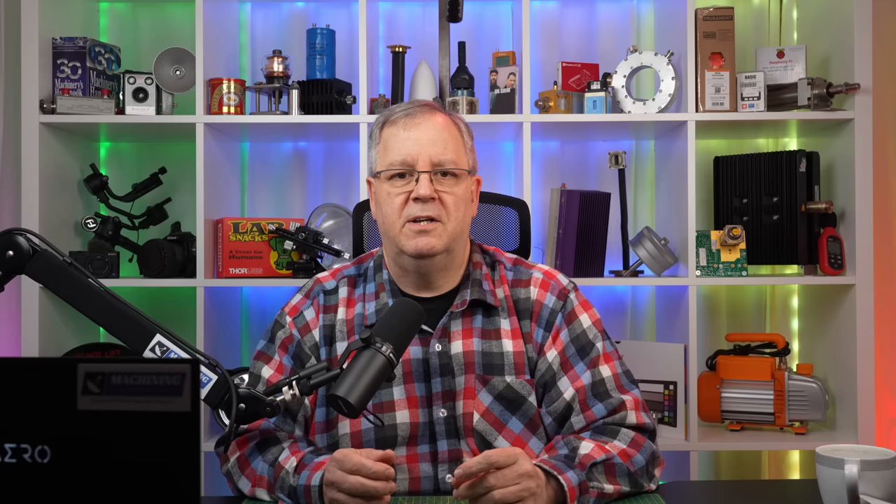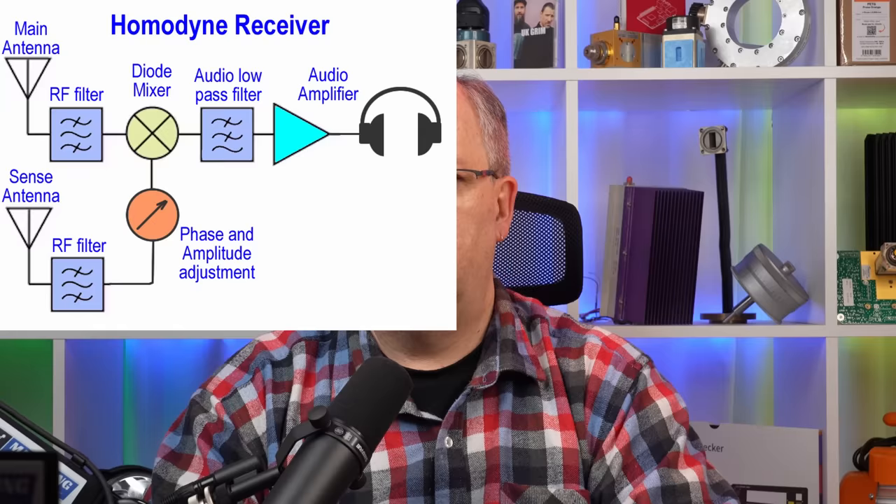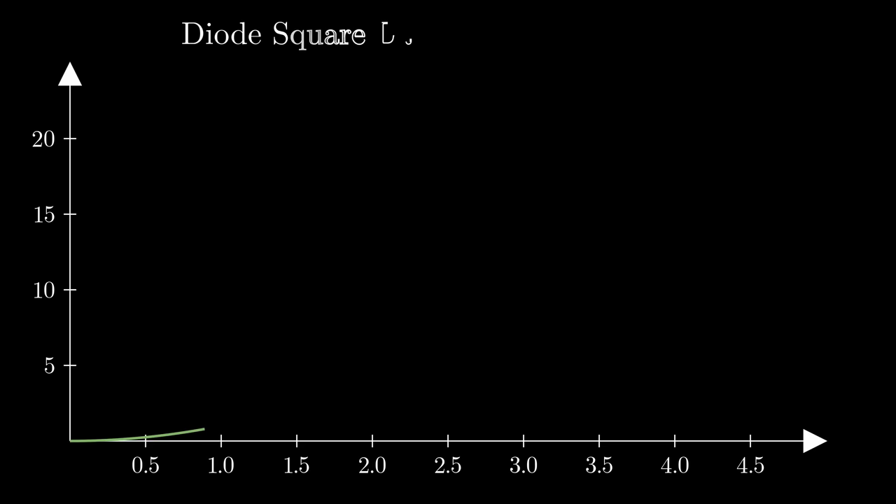Helical and Yagi-Uda antennas were certainly known at the time. The receiver was probably a homodyne. If they picked up a sample of the illuminating signal from a sensing antenna, it could be used as a coherent local oscillator and mixed in with the receive signal, tweaked a lot in phase and amplitude to get the best audio response. I guess they'd have a cabled intercom to the transmitter site for talkback liaison, as well as fiddling with the receiver settings and antenna setup. It's certainly possible to use a modern AM receiver, but local oscillator phase noise and frequency stability would have been big issues back in the 1940s. The homodyne might lack sensitivity, but you'd just need to make up for that with a bit more power at the transmit site or higher-gain antennas. You need infinite patience to adjust all the different parameters as they change with humidity, temperature, people moving in the room, foliage moving in the wind, and noises from pipework and other metal objects.